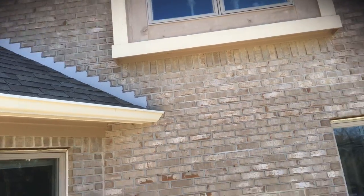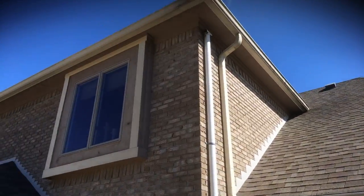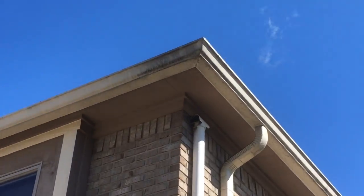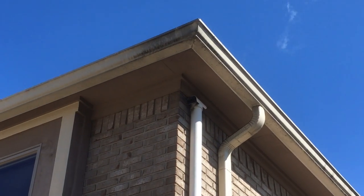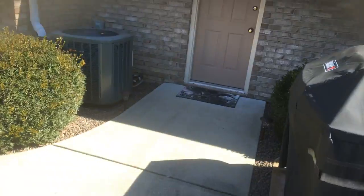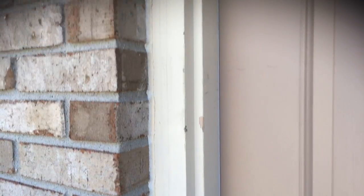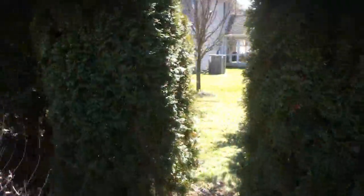You've got boards with cracks that just need to be re-caulked and sealed so they don't continue to get worse. There are areas on this gutter all the way back that need to be power washed really well to get that black mold growth off. There's also chipping on the door frame that needs to be scraped and primed before we paint. And then the final side is just some more soffit and gutter board.